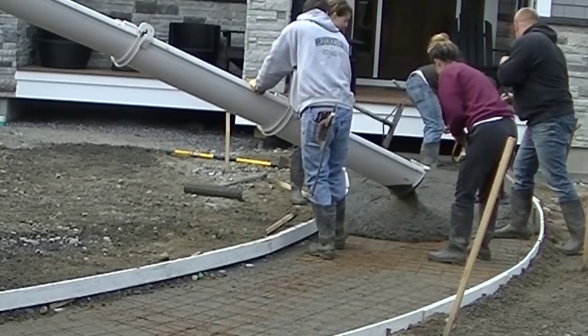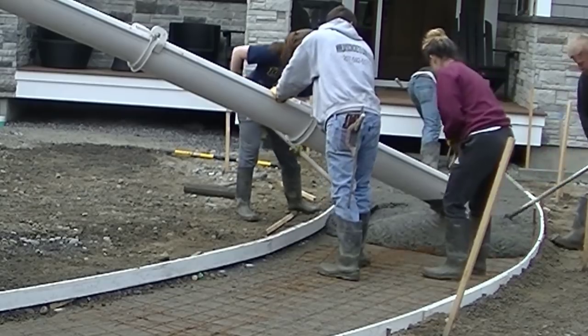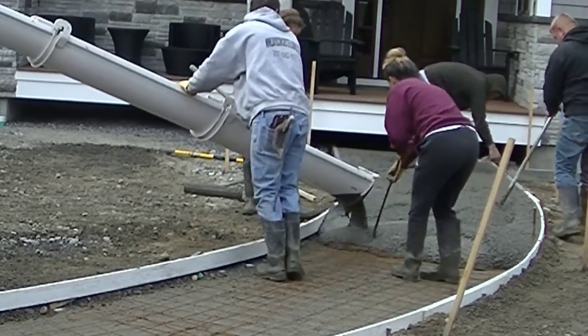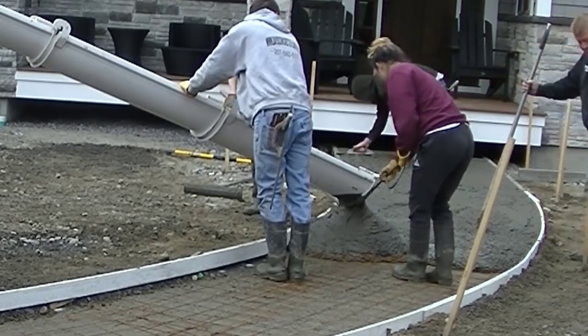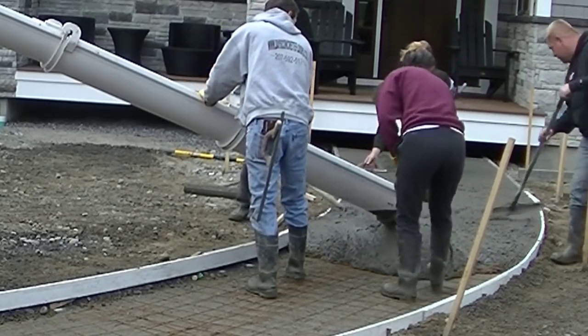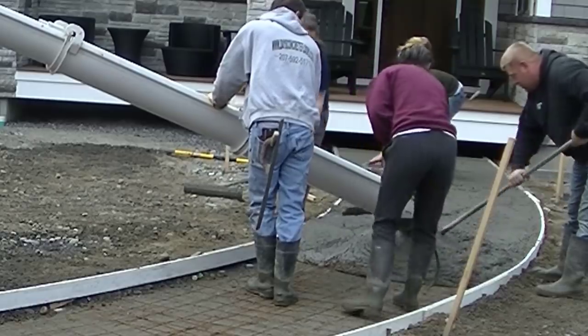You can see Tia's got the wire puller — she's yanking up on the wire into the concrete as we go. That's how we do it. Once you get the concrete under the wire, the rocks and concrete hold the wire from going back down to the bottom even if you walk on it. This method works pretty good. Plus we got fiber mesh in the concrete too, so we got a double reinforcement.